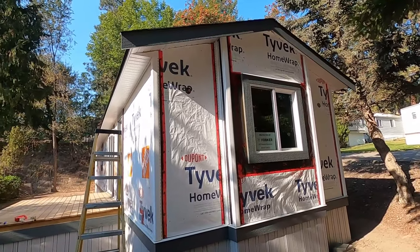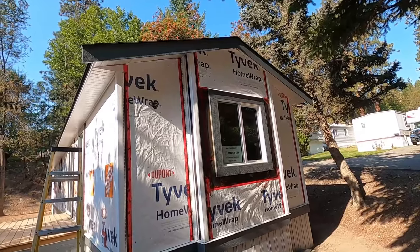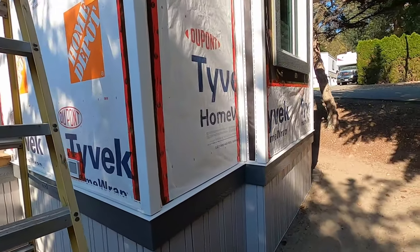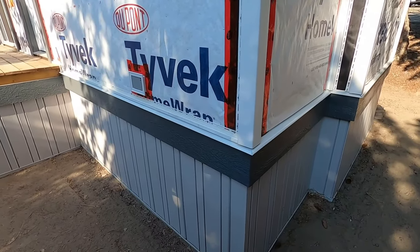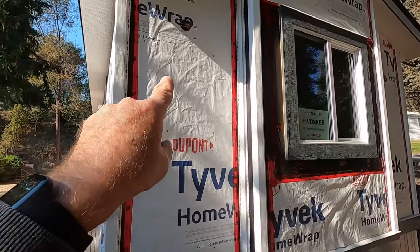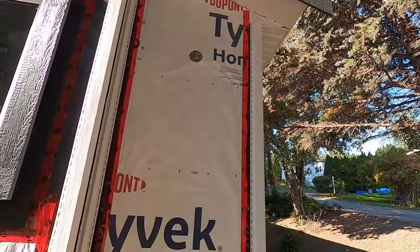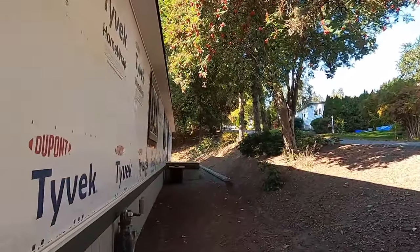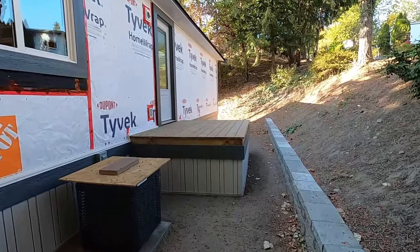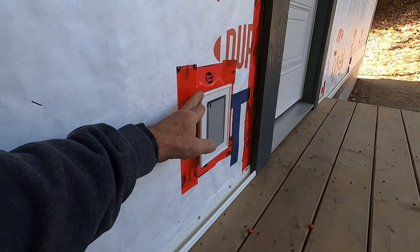The house wrap is all on and sealed in. The top piece comes out over top of that flashing I showed you. The next thing is going to be installing the J's. There's a lot of J's involved with vinyl siding — that's a really big component of it. But before I do the J, we have to do something with the outlet for the light as well as one over here. We use these little mounting things — blocks — to work our vinyl siding around them. Here's what the plug looks like. You just buy these little things and install them; the siding will tuck in behind this flange.